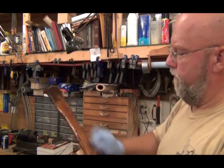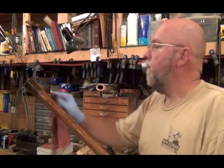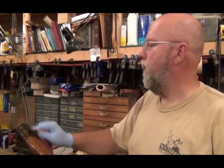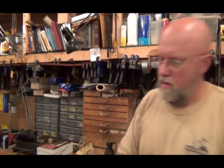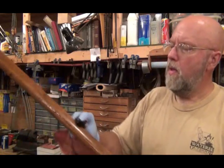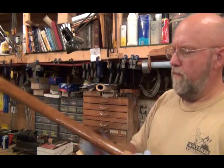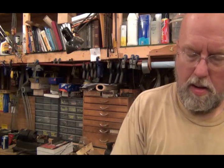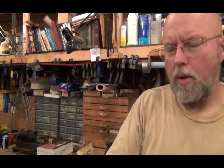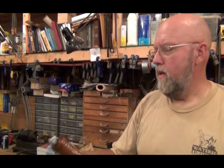It will give you a nice finish, protect the wood, and it will give you less of a slippery finish than the varnish that comes on them — that gets kind of slippery. There are some gouges in this, so I'm going to make sure I get it deep into those cuts. What happens is the boiled linseed oil will evaporate and dry out and it helps the pine tar penetrate the wood. This is probably old, old hickory.